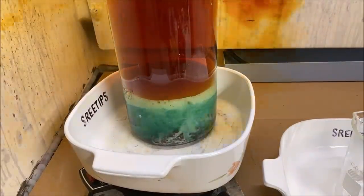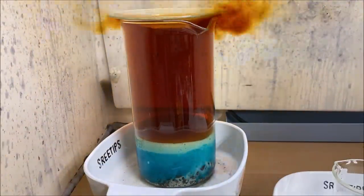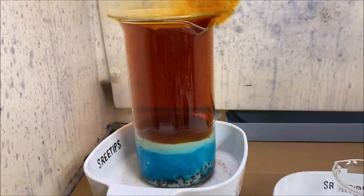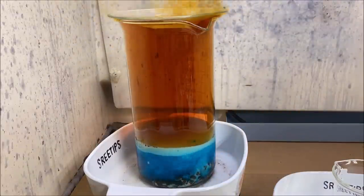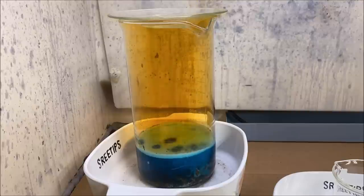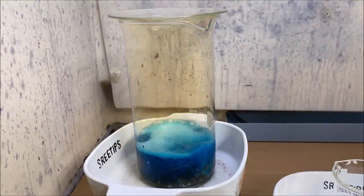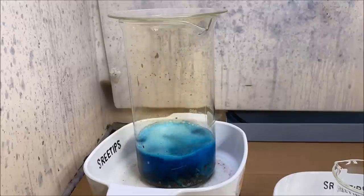Many of you may be wondering, why did he alloy sterling silver with the karat scrap? And the reason is we alloyed that additional sterling to make a 25% gold alloy. The rest is 75% silver and base metals. Now, these boiling nitric acid treatments can penetrate to the core of each piece in there and remove all of the silver and all of the base metals. The nitric won't dissolve the gold. It gets left behind untouched.